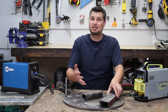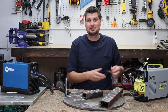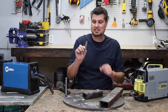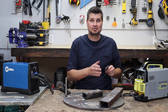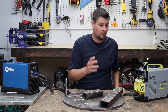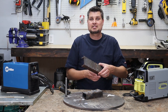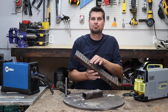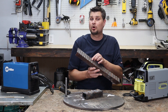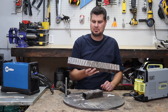One of the best things you can do is practice. I keep whatever scrap material I can — everything from old edger blades, because this is a perfect eighth-inch piece of metal right there. Put a couple of those together, do some fillet welds. I get some longer ones to lay down longer beads and practice my bead technique or pattern, and also practice how straight I can get it.